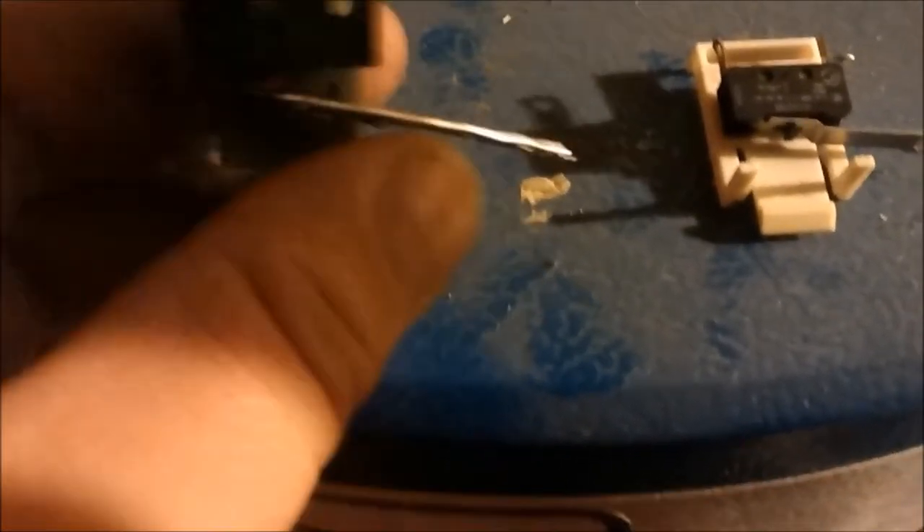The plastic ones on this one — these are little cuts of coat hanger through drilled holes — and it seems solid. Let's slide it in and see how it works. You can hear that whirring — the pump's working and we're back operational. 3D printer and micro switch on hand: cheap repair, saves having to call in a technician.